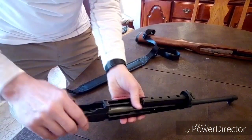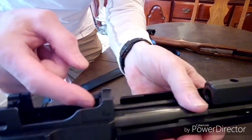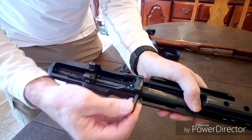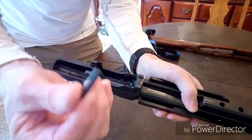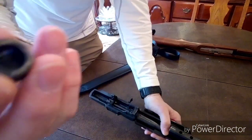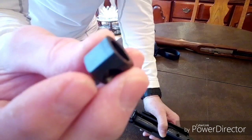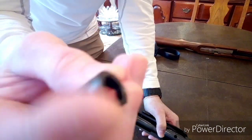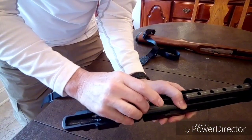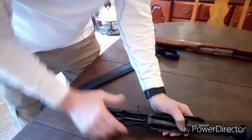Now, once you do that, this bushing that I talked about, which is right in here, has a little pin. If you just tilt the rifle one way or another, the pin will come out. It's just a piece of metal rod, and you can now remove that bushing. Okay? You'll notice that the bushing has a flat part on one side and it's rounded all the way around. That flat part will go down when you reassemble it, and I'll show you that in the next video when we reassemble.